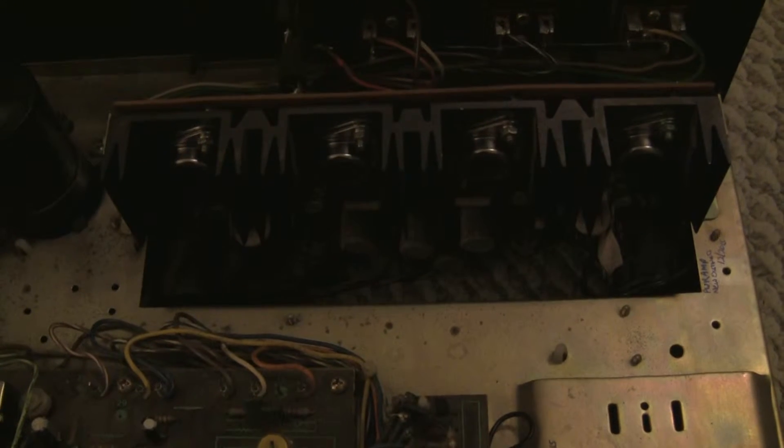Looking at this other one here — if you have a Pioneer unit and you have this white-looking Nichicon trim pot, it's got '101' on it in this case, those are no good. I have had several pieces of vintage Pioneer equipment come to me where those have been open. In this particular case, somebody put 7-amp fuses for the amplifier instead of the required 2-amp fuses, and the bias pots opened and ultimately destroyed the output transistors.